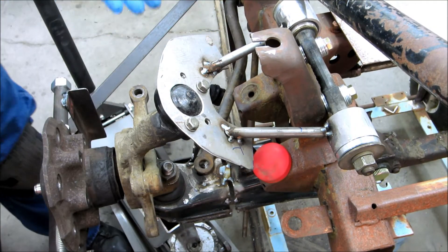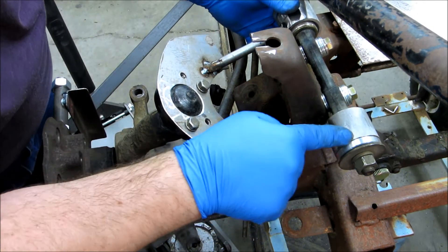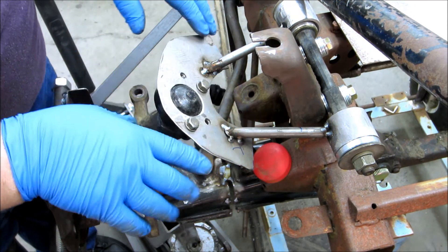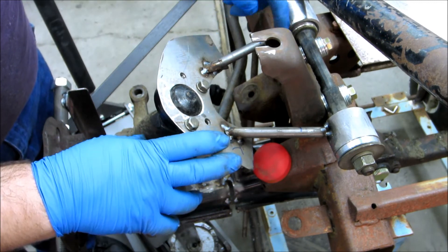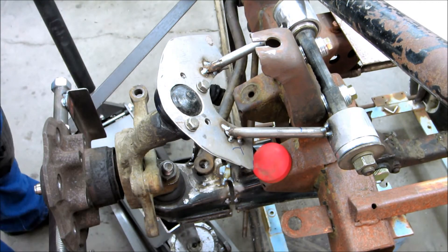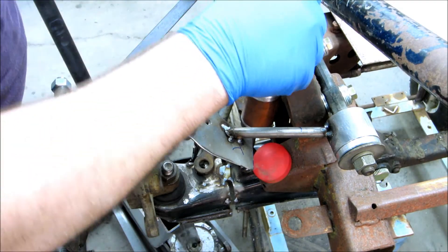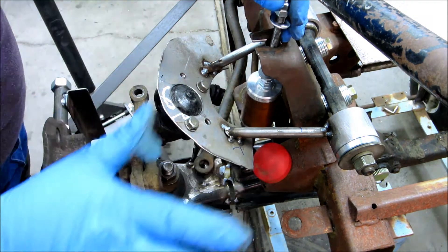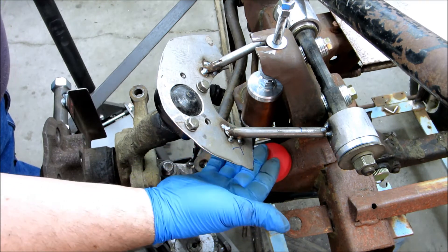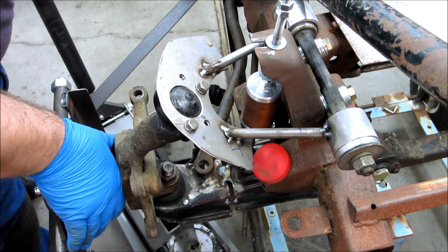We're back — we're at the top of the suspension, up against the bottom bump stop. Got the sheet metal tacked in. A couple of things: I had a little extra gap, but most of it went away when it got bolted down — might have been a little curve in the sheet metal from the heat. I also forgot to cut this side and move it over a little bit, so I'm still looking at the same eighth of an inch of clearance there. Let's drop it down. We're checking clearances with some kind of shock in there — as you can see, that represents the shock body. Tons of room there, not an issue at this point. It's when it goes down that I'm positive I'm going to hit on the bump stop.